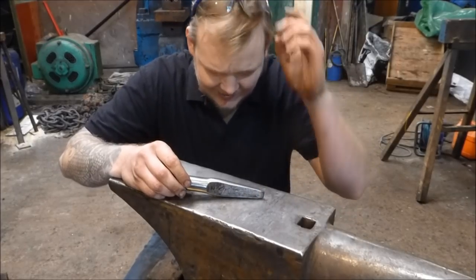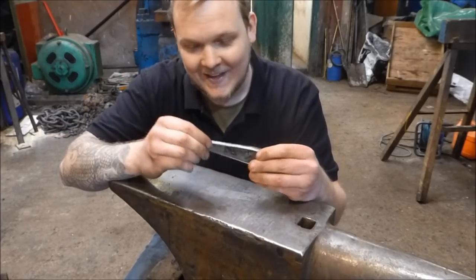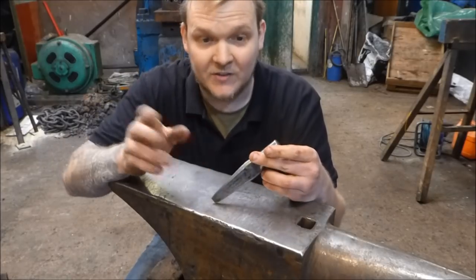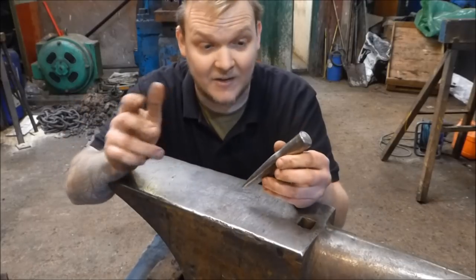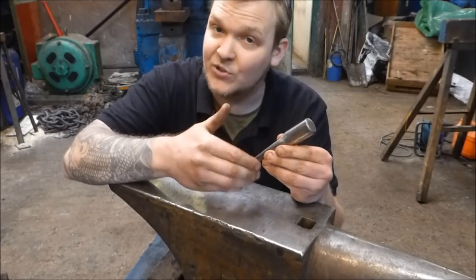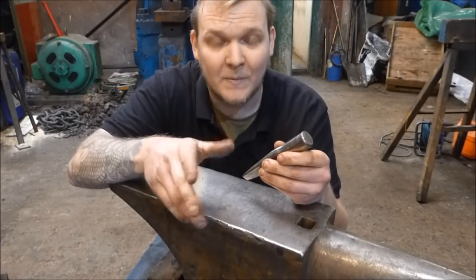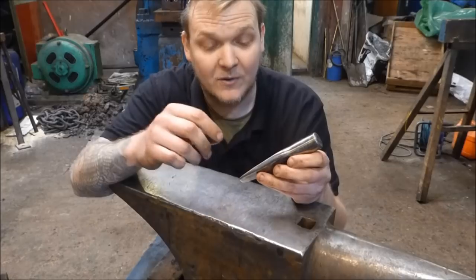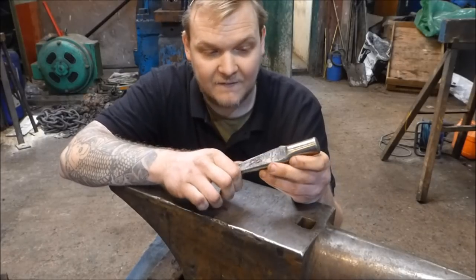So I've done a little bit of polishing up and grinding on it. It won't grind easily — I had to put a normal angle grinding disc on to get the meat out from the front, and then the flap discs just weren't touching it. It sounds like glass. But I've given it a whack a couple of times and it's not shattering. Titanium isn't really heat treatable to any real degree — you don't harden it, it just becomes softer as it gets hotter. Titanium has a temper range — you can temper it, but it's more like a feathering process where you get oxidisation colours coming through. Titanium is very beautiful — it has lots of different colours, everything from blues to purples to greens to reds.